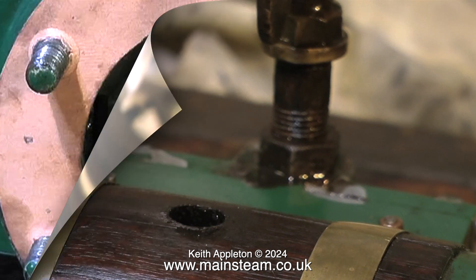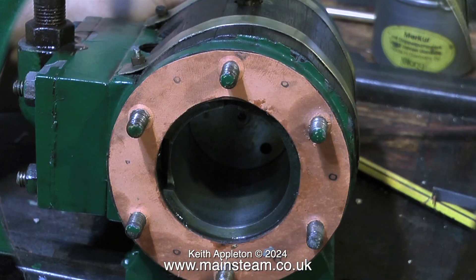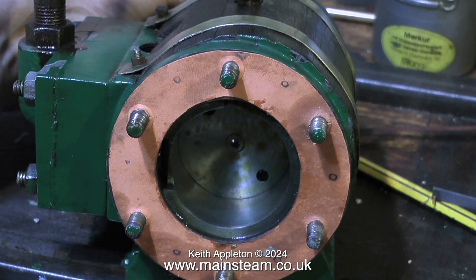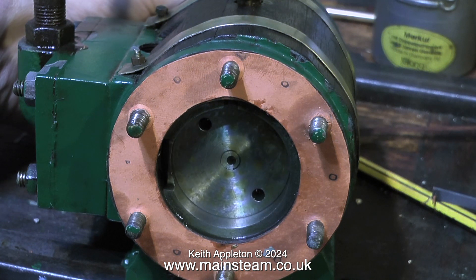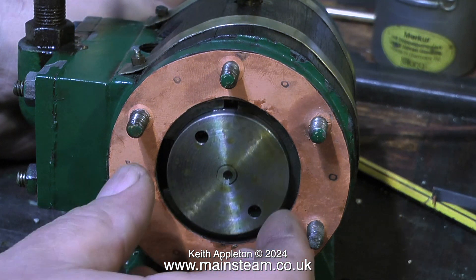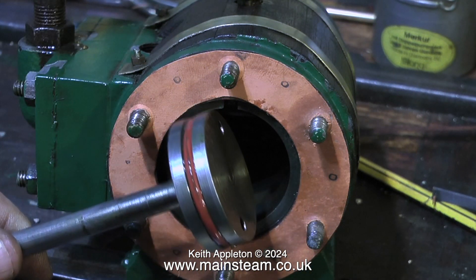The fix I finally used was simple yet complicated. I machined a cast iron sleeve and fitted it to the cylinder. I also machined a groove full length across the top of the liner, which allowed the oil to flow from the cylinder oiler in the center of the top of the cylinder to either end. Here you can actually see where I've relieved the end of the groove so that the oil could flow into the cylinder from the lubricator.